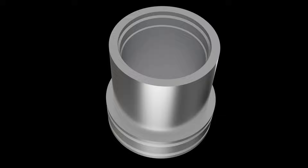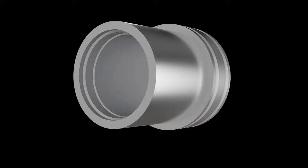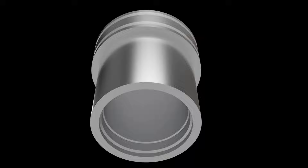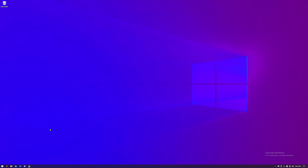I've also made a 3D model of the torch head, just so I can play around with what can fit inside it. There's quite a lot of space in there for inductors and capacitors — the two main big things on our new control circuit. So with that I can find a datasheet for an inductor and check whether it'll fit. Of course that's easy if it's a circular inductor with a diameter and height given, but if it's a cubic inductor I'd much rather just draw it in Fusion than have to do the maths.